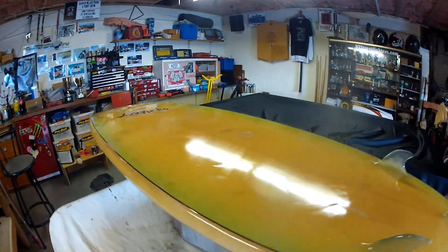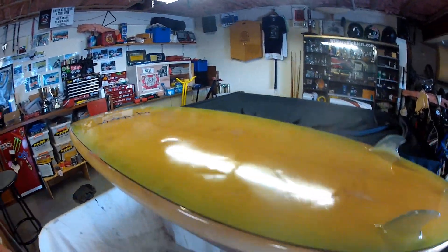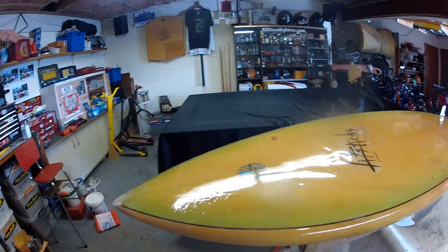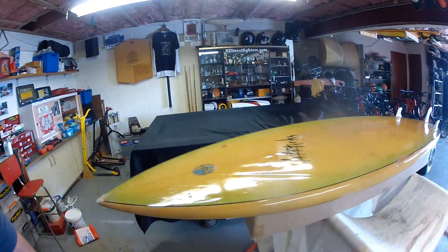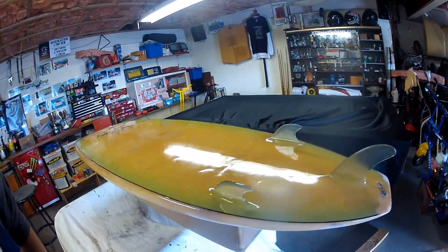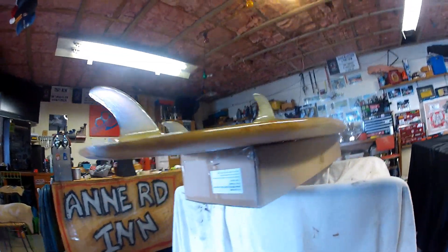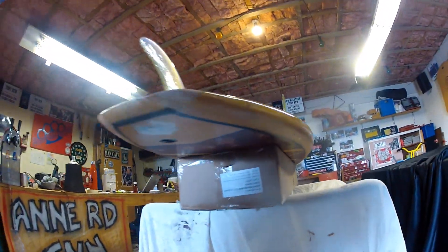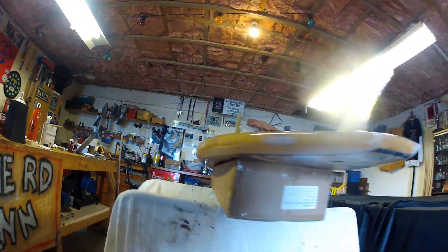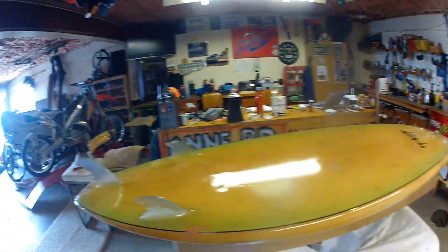The board is now just starting to flash off. You can see in the light if I move it — the reflection shows some brush marks in there. It's quite dirty on the bottom, lots of dust in it unfortunately. I'll try and cut and polish that out. I've removed the tape and there's a line there I may sand out as well, then go for hand polishing next.